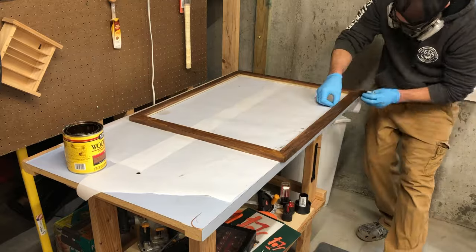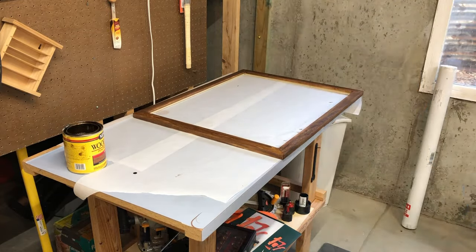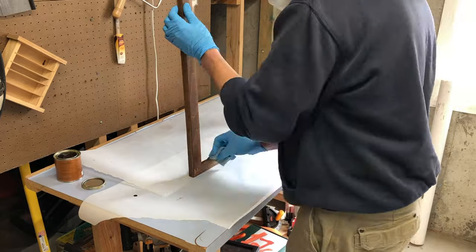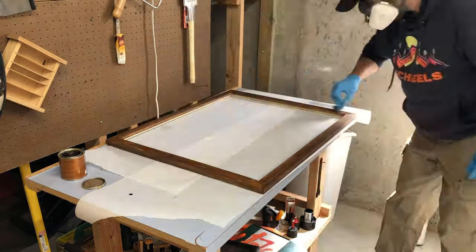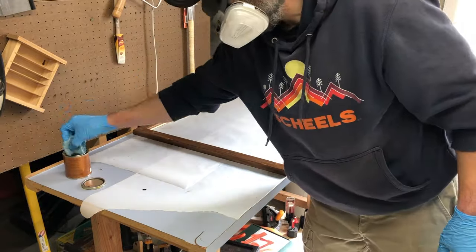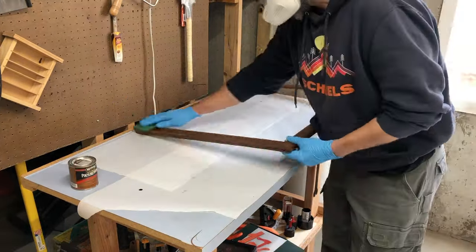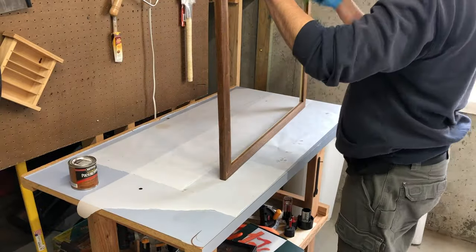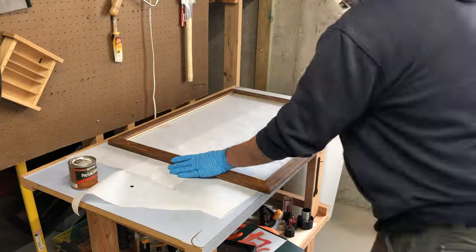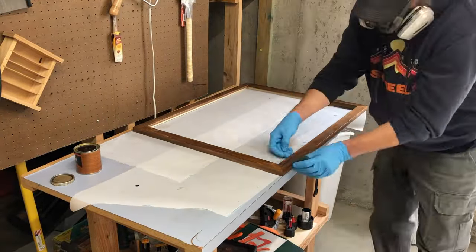I also changed out my dust mask for the canisters. I prefer to use those if I'm using any oil-based stains or finishes. Now I'm putting on the first coat of the finish — this is a semi-gloss oil-based finish. I'm using a shop towel. It's better to do several thin coats of the finish than a few thick coats. In between coats, I'm just using a Scotch-Brite pad to clean up anything that's sticking up, and then I take a shop towel and wipe off any excess before I start putting on my next coat.